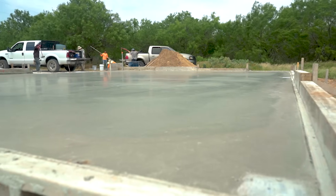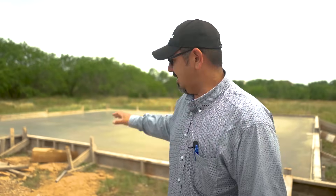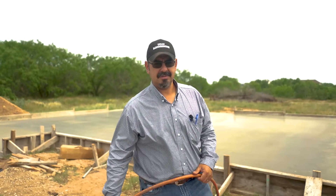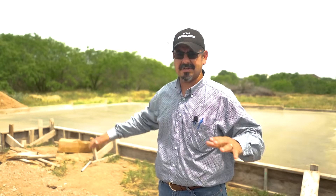So there you have it — a 30 by 40 slab done. We're going to leave the forms on, come back tomorrow, pull them off, and then plaster the slab. The customer is going to put a sprinkler on at 2 p.m. Right now it's still a little too green — that's what we call concrete when it's not completely dry. A couple more hours once the sun really starts beating on it, go ahead and put a sprinkler on it for a couple hours, make sure the slab gets nice and wet, and do that for about the next seven days every day. Concrete needs water to set — concrete will actually set up under water. If you're pouring concrete and it starts to rain, don't think it's not going to set up — it is. I'm Eric and we are Texas Barndominiums. See you next time.